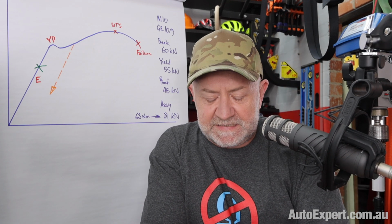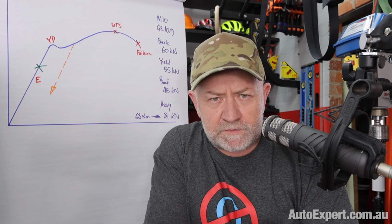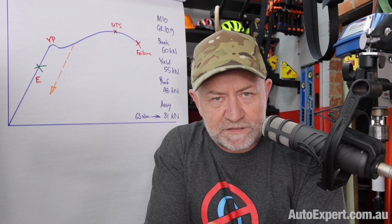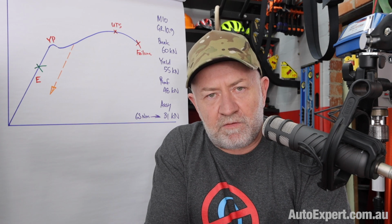And the other problem is it's not that difficult to do the angle tightening thing, but you do need an angle tightening gauge because you don't want to estimate 80 degrees or 65 or whatever. You want to measure it. And you can buy one of those things. It's not that bad, but it adds a layer of complexity.